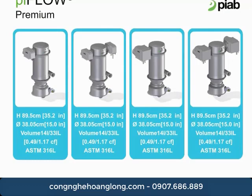For non-free-flowing products, we can also introduce a fluidizing cone option. The fluidizing cone is at the discharge of the conveyor, and it creates a fluid bed similar to an air hockey table that helps the product discharge out of the receiver.